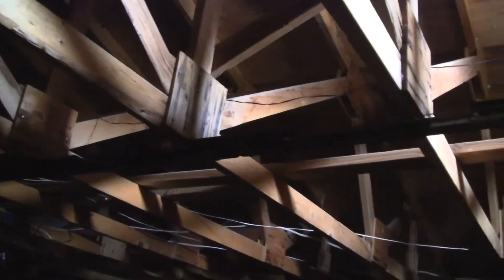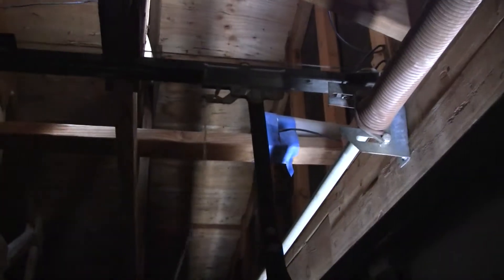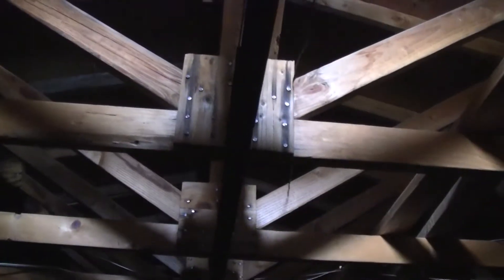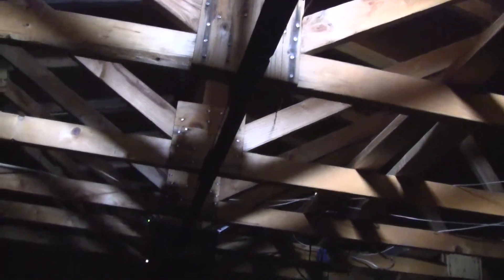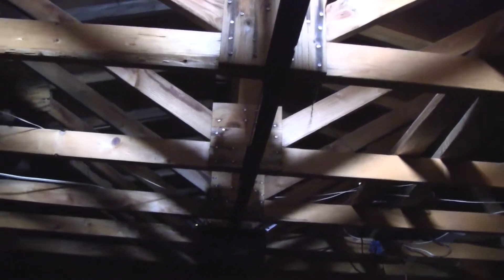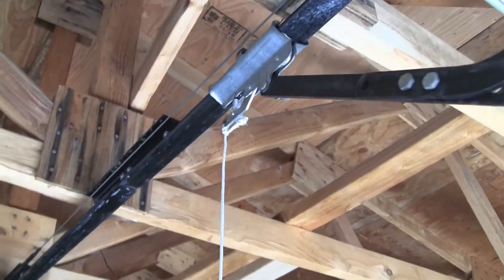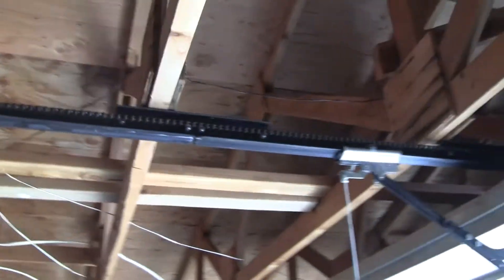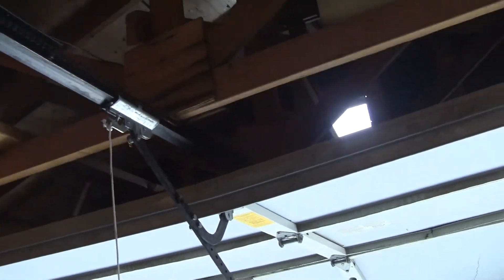I'm going to bring this over, connect, close the door, and then reverse it and watch what happens. It's a little dark but it'll get better as I open the door. The chain along the track would get super slack on one side, just as the door was a foot above the floor. Now it doesn't do that at all, even with the door being a little too heavy right now. See the chain? It's not working too hard to pull it up, but it would go slack like crazy — several inches of slack.